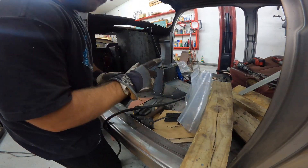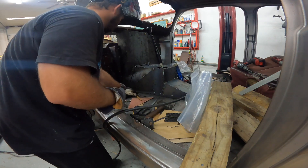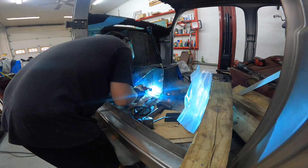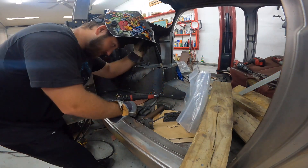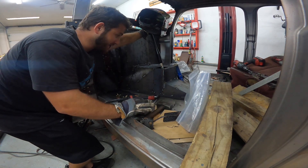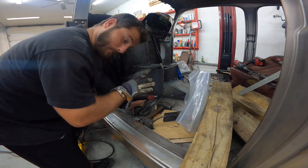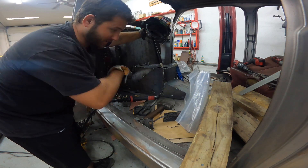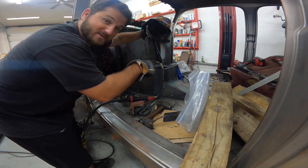What I'm doing is cutting every one with a plasma cutter. We have this inch-and-a-half flat stock that basically fits right in there perfect, and then welding it in one piece at a time. The whole idea is I'm putting it all together, and then later I'm gonna weld it all solid because it's just tacked right now, then I gotta grind everything smooth. One step at a time: first finish the tabs, we gotta drill holes, then weld the nuts for the bolts — because all this is going to be removable. Finish the tabs, then do the holes.